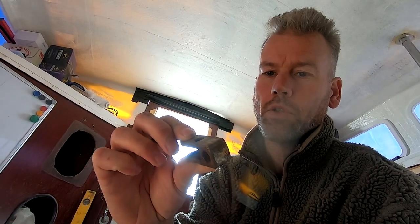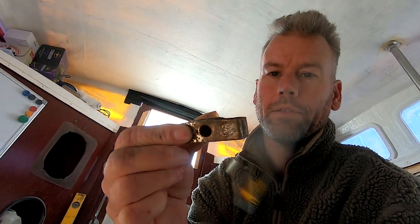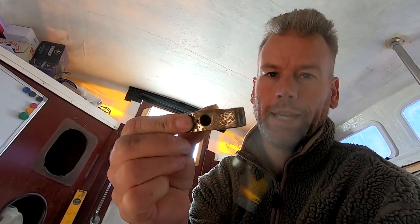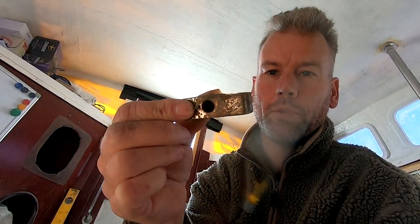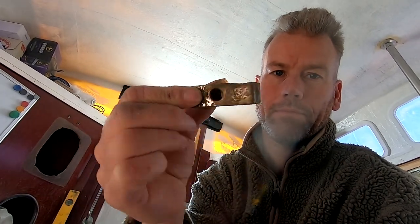So I'm going to ream it out again now with a drill bit, make sure it's all nice and shiny, give it a good clean up, and nut and bolt it with nylocks so I can adjust how tight or loose it is. And I'm going to put some nylon washers top and bottom just to aid it in its turning basically. That's the plan for that.